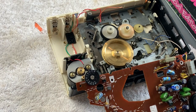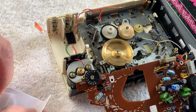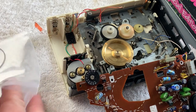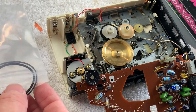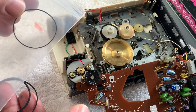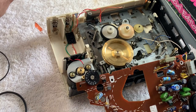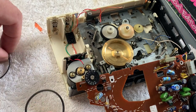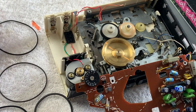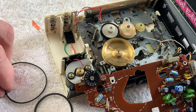In terms of the belts, I use Deck Tech in the UK - I've found them to be absolutely superb. Great communication, excellent product quality, very fast delivery. They're not sponsoring this video or anything, but these are the guys I use for all my 8-track and stereo repairs. This particular kit at the moment is a three-part kit because there's a counter on the M4440, but it's otherwise the same kit. They will shortly be offering a kit specifically for this model, but the replacement belts we need are actually the same as the M4440 and M3330 - you just don't need the counter belt, that's all.